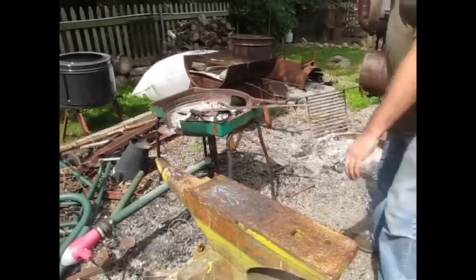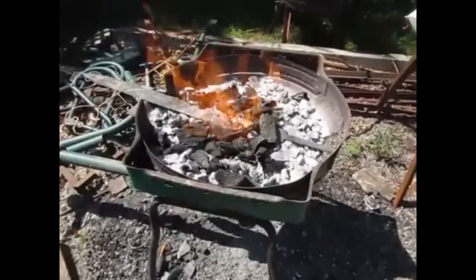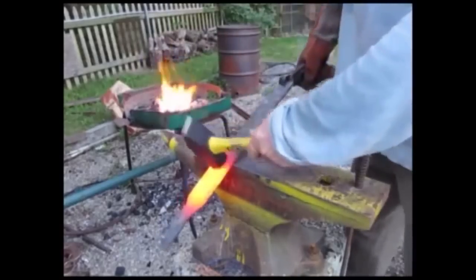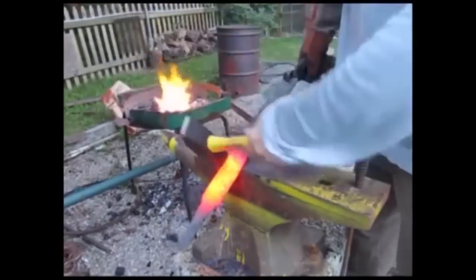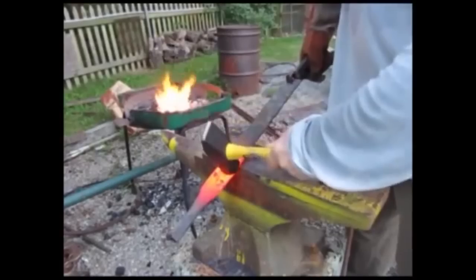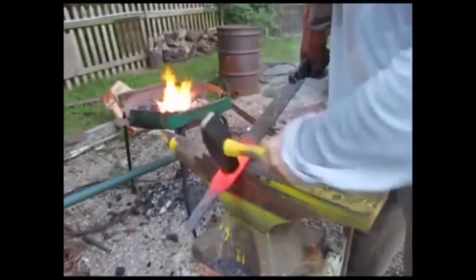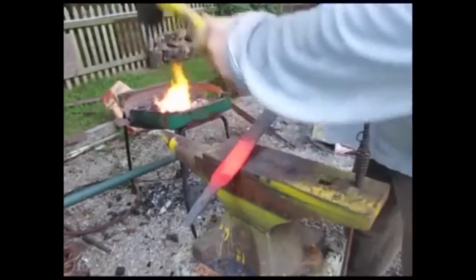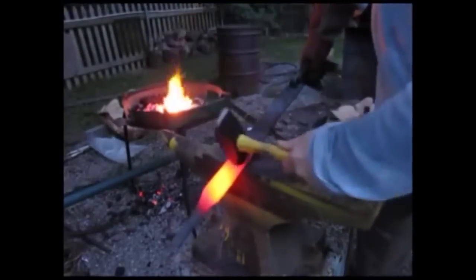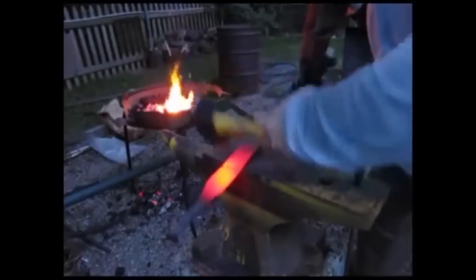Let's take a look at the reasons why we make a sword forge. With a regular forge, you have something called the fire pot. That's where the temperature gets really hot in that small circular area, where you can heat up the steel to 2,000 degrees, roughly, depending on what you want to do, and then work on it. And for a sword, that's quite okay, because you work on it in sections — I'm only working part of this sword, and then you heat another part and work on that part of the sword. So a forge with a circular fire pot is quite fine for that.